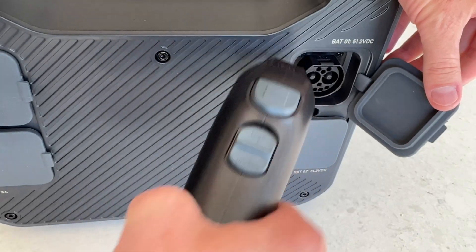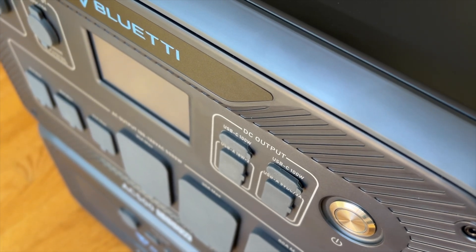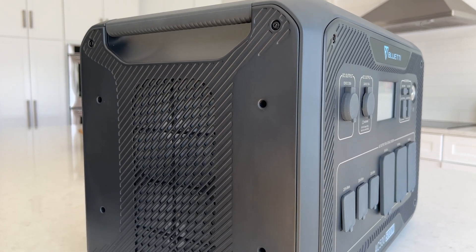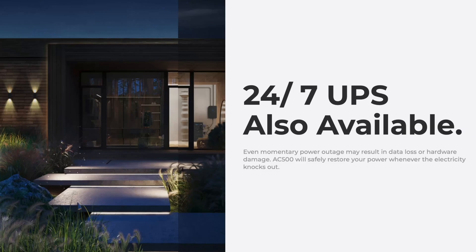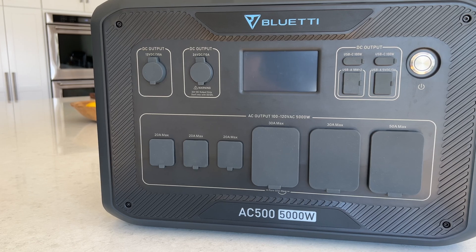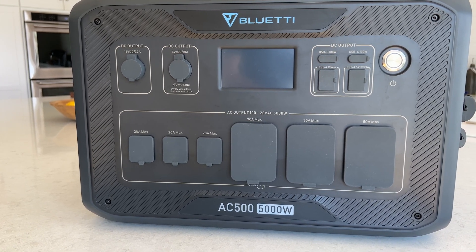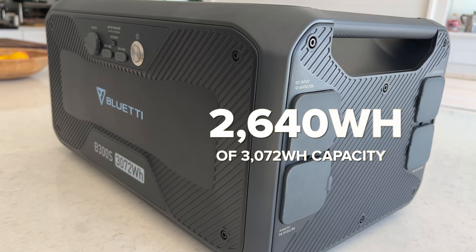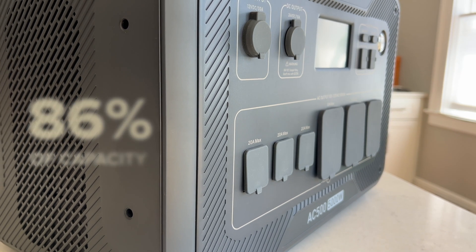There are two battery ports that connect with a super beefy cable that locks in place. In my early test the AC inverter has worked flawlessly and can easily power three 1,500-watt space heaters for 20 minutes without even breaking a sweat — the fans are super quiet even when pushing this hard. The AC500 can also act as a UPS, automatically switching from wall power to battery when the grid goes down. To test inverter efficiency, I discharged the 3 kilowatt-hour battery over five hours in a 0.2C test with a 500-watt load and was able to pull 2,640 watt-hours of the 3,072 watt-hour rating, which translates to an 86% efficiency — very impressive compared to the 80% average, especially for such a large powerful inverter.